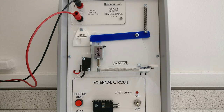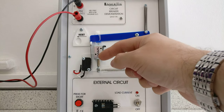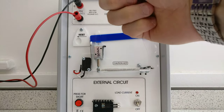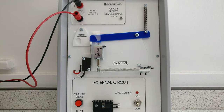The other way to do it is to have a solenoid, a magnetic field generated. In here this is a solenoid — a magnetic field is generated when an excess of current flows and it pulls up an actuator that pulls up a metal rod which pushes the switch up and turns off this switch here.